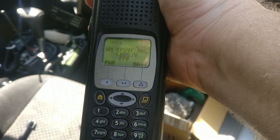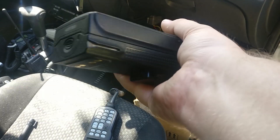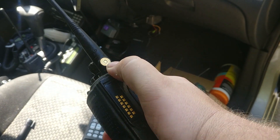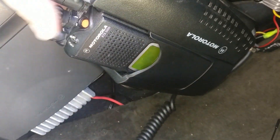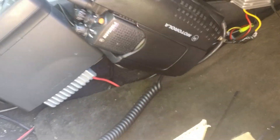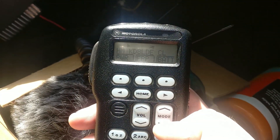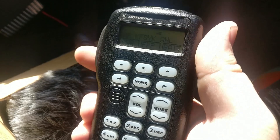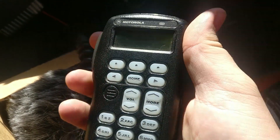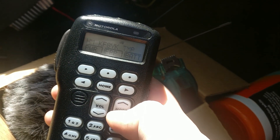Keeping with the theme of Motorola P25 radios, here I have my Model 3 XTS-5000 — a 5 watt portable radio for the 70 centimeter band, with an antenna connection made up with the one inside of this XTVA Converticom. This allows me to simply take the radio, insert it into the adapter, and then pull up all of the same channels from this handy W3 mic controller in my vehicle. The only downside is that if I forget to bring my portable with me, I no longer have 70 centimeter capability in the mobile.